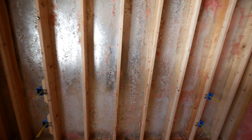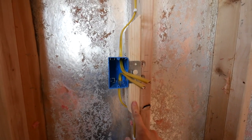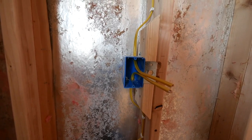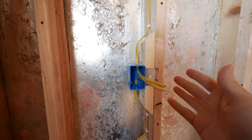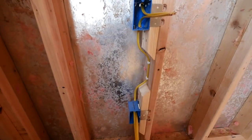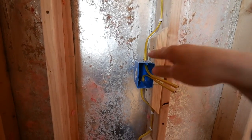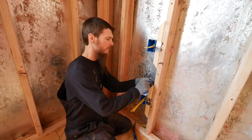But there's one job I've got to do before I start — this has been bothering me since last night. When I was doing the electrical work, I wasn't thinking. I put these blocks of wood in because I wanted to move these outlets over an inch and a half. Now that I'm looking at it, I'm going to have to cut my insulation around the box, around another one, plus cutting back here to fit in this gap. That's a lot of notching, cutting, and potential for gaps, cracks, and air leaks. I'm taking this all out and putting in a two by six from the floor up. Just one of those mistakes from not thinking ahead far enough.